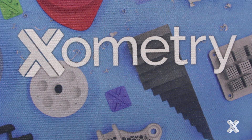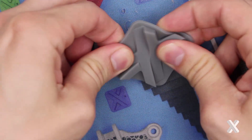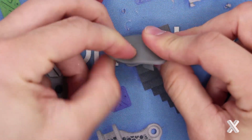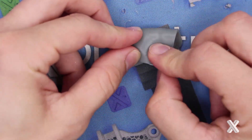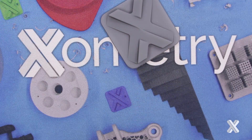Another awesome material, adding to our list of end-use elastomers straight from the printer, this is SIL. It's a silicone material, so I have some stretchiness and responsiveness. This is a Shore A35, so it's got that kind of chewing-gum squish to it. A really cool elastomer that directly 3D prints. I love having this on our lineup at Xometry because it fills a need that we just really couldn't fill beforehand without doing a urethane cast to get that.